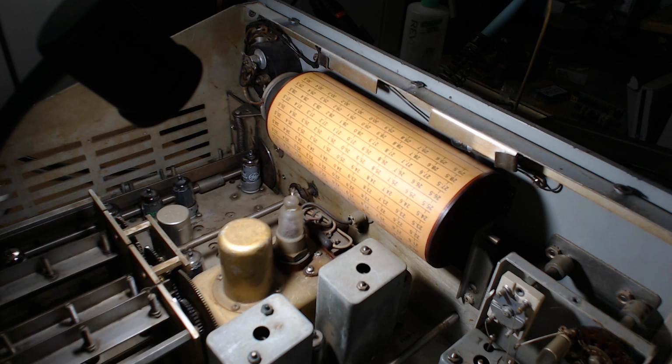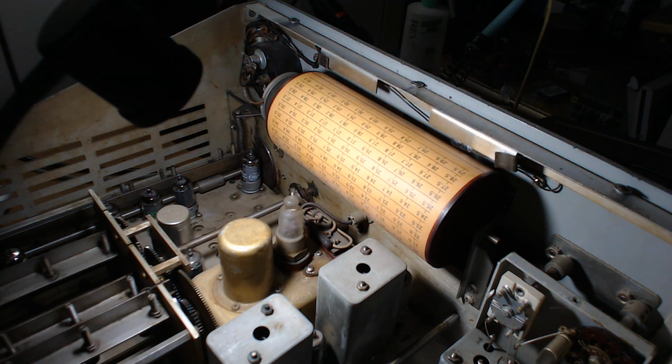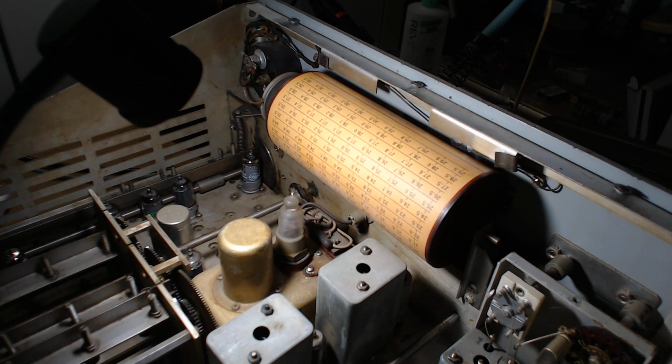I admit it, I don't know. I've never seen anything like this before. Now, remember, this is the VFO unit, which Collins calls a PTO because it's tuned with a ferrite material, a piston, in and out of a coil. Now, one guy says that this unit does not have that system. While I've seen other pictures, it sure looks to me like there is a coil in the unit, and it's a 10-turn coil. It's not a 10-turn capacitor. So I'm suspecting that person is wrong.